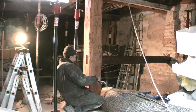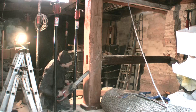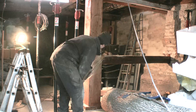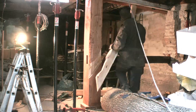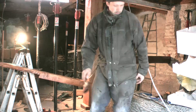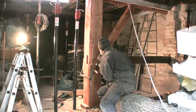The slot for the joint is marked and then chiseled out. The chainsaw is again a very useful tool to speed things up. If you are wondering why the lap joint is going all the way across the post without leaving space for another brace on the left side — we found out that there was no brace there, but a larger window or a door. Last, a hole was drilled and the brace fixed to the post with a wooden peg.